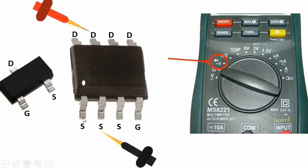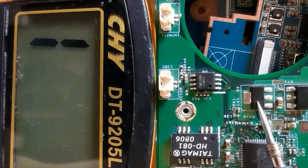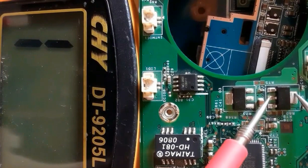We have the MOSFET here — always three pins for source, the fourth pin for gate, and the four other pins for drain. Always this dot or white dot marks pin number one. So we're going to use the multimeter to test any SMD MOSFET. The terminals in the middle are connected together and are for drain.